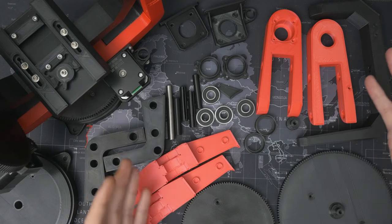Now that the tilt arm assembly is assembled you can see why we had to epoxy that one bit onto the other side of the arm - it lines up with a similar protrusion built into the 160-tooth gear on the other side, and this is the axis around which the tilt arm rotates. We just need to attach the tilt arm to the pan assembly using the two side supports and then mount the whole thing to the base. We're returning back to recording while I'm actually filming now - I don't know when the audio cut out but I will have no doubt applied a suitable voiceover.